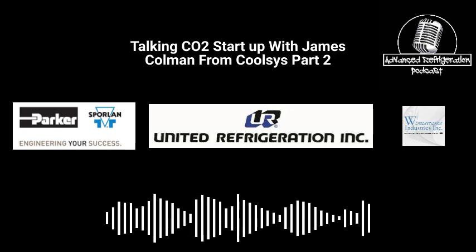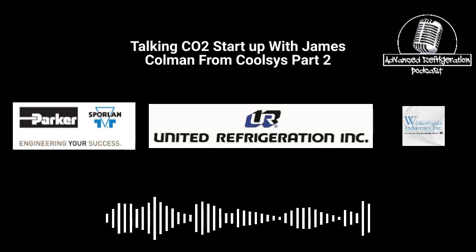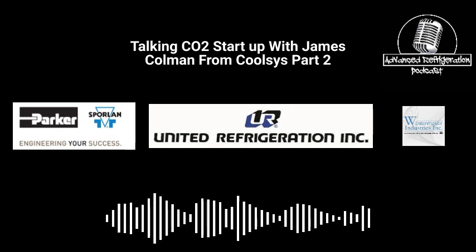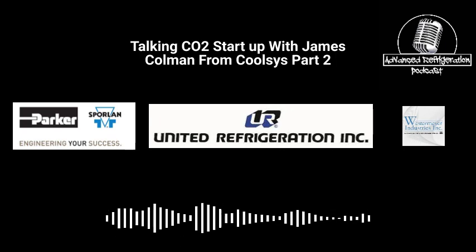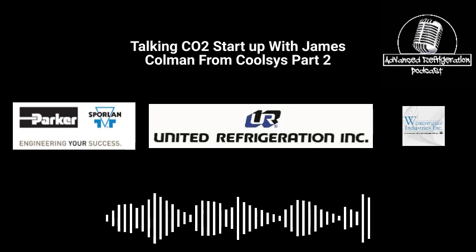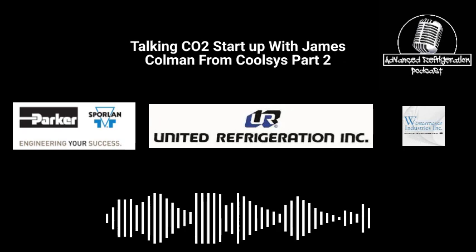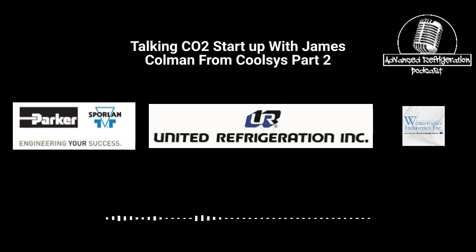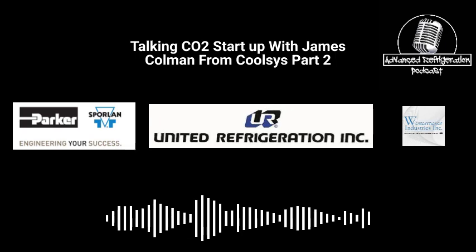You have such a low load on the store but all your compressors are running. You're variating the speed of the lead compressor on the drive between 80 and 100%, and it's minus 20 outside, all your cases are at setpoint. It's all coming from your flash tank - literally the whole load of the rack. We found this messing around in the 326.